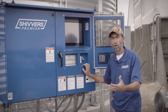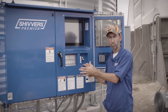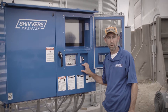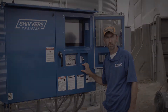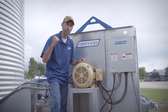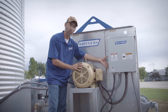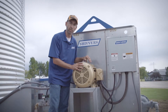That's the general rundown on basically starting up one of these systems. Now we're going to go through some fan settings and see if we can get one of these fans to start up. Once our fan enable switch is turned on in our premier panel in the front of the bin, we can come back here and start the fan. There's a momentary start switch — it says momentary fan on. We push that down, let up, and that'll start our fan.